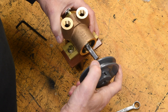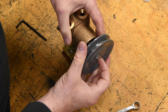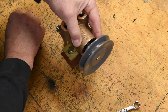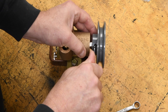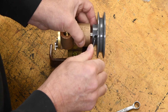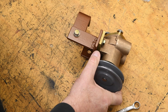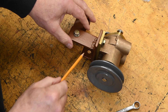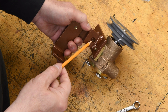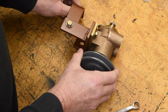Go ahead and slide your half-inch pulley on, making sure one of the set screws lines up with the flat of the pump shaft. Line up the front of the shaft so it's basically flush with the front of the pulley, then tighten down your set screws using a 5/32nd Allen wrench or a 4-millimeter. You'll notice there's an extra mounting hole on the bracket — you can disregard this unless you have an early model accessory drive with a 5/16-inch threaded hole on the side, which gives you one more anchoring point. An extra bolt is included just in case.